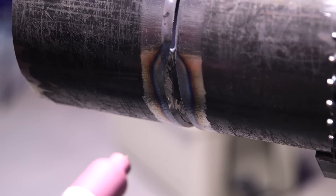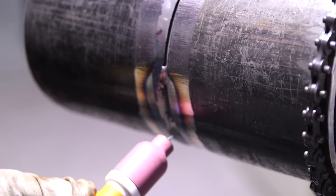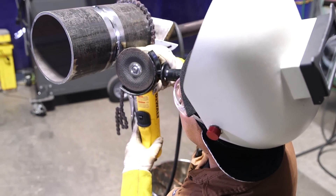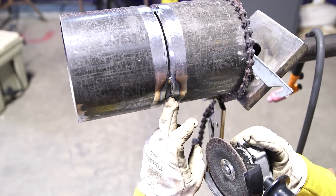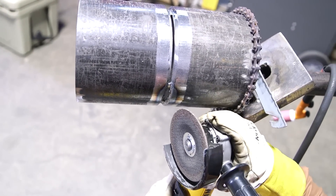So what I'm going to do next is with no filler metal, I'm just going to basically use this TIG torch and run it down the edges quickly to try to burn off some of those burrs. Then we'll go back with a grinder, clean it up again, and then we'll repair it. I'm going to use my grinder and do this kind of motion - kind of clean up that rounded edge we got with the TIG torch.